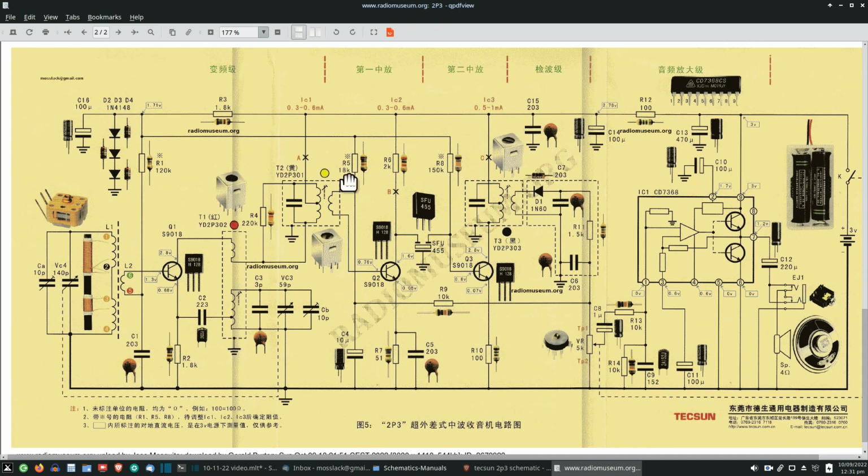And I think I already mentioned that I did check all these diodes here. They're all correct. I checked the detector diode, wherever it's at over here. There it is. It was correct, and now that doesn't mean it's good, but it does mean it's in there correct. I did find one solder joint just by looking at it on a resistor, and I don't know which resistor it was, but it looked a little suspicious. It didn't really appear to have much solder on it at all, and it just looked like it was tacked in. And so I may go back over that and double check that with the soldering iron once I get it hot again, and do that. So all right, that's what we're going to do.